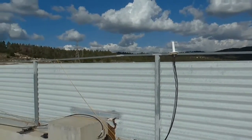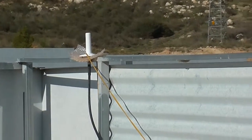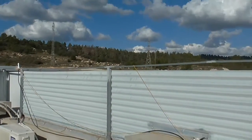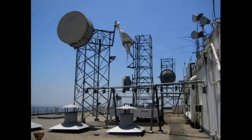Now we need to install the outdoor unit on the roof. First, the two provided Iridium antennas need to be four meters apart from one another and at a slight five-degree tilt away from one another. Second, and equally as important, we want these two antennas far away from other transmitting antennas and definitely not in front of a transmitting microwave.